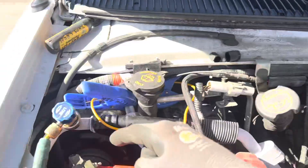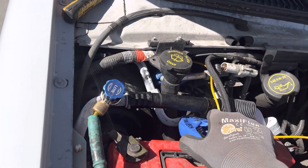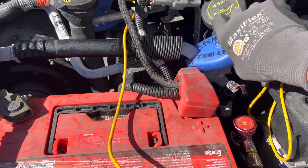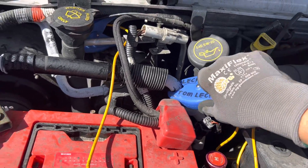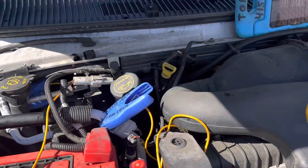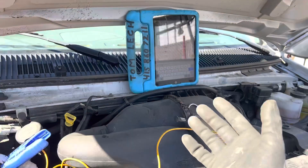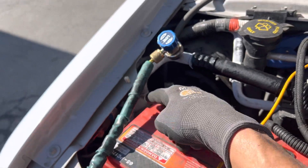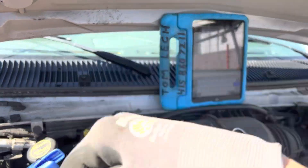Now let's look after the accumulator. Where it reads 35 degrees, we should have a pressure drop going through the accumulator. Let me clamp it on after the evaporator. Unfortunately, ice is a poor conductor of heat — I need to get the ice off there because you cannot conduct heat through ice. Ice is actually an insulator. Now you see it's 32 degrees — it dropped. Why? Because there's a restriction. Having to travel through the accumulator is another restriction, and when you restrict refrigerant it drops in temperature and pressure.